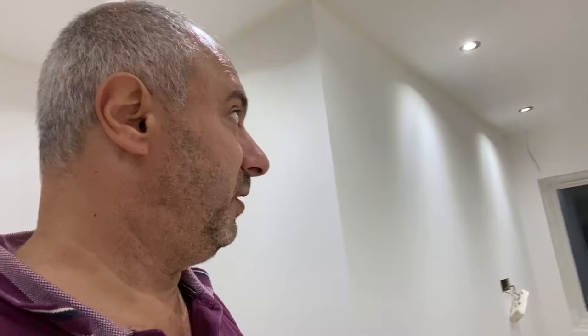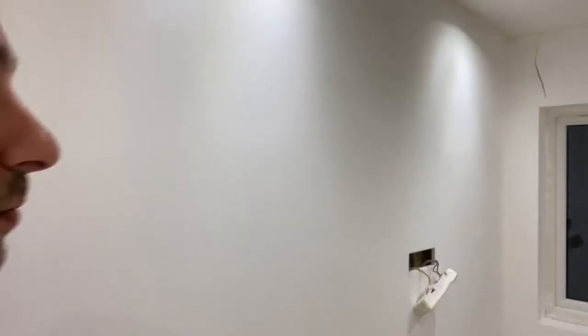So, this strategy now, how are you gonna paint? With the final finish, you can't just paint the way you like. I wouldn't say rules or anything like that, but when you have an office like that, which has a window this way and a window that way, you've got the sun coming in. And when you're standing at one end and looking parallel to the wall, you would see a badly finished product. So basically, it's to do with streaks going left, right, and center, and all that. So the way to do it is to paint the walls in lines. So you've got line one, line two, line three, and so on. That's the strategy of painting this long wall, right? This is how it's going to work.